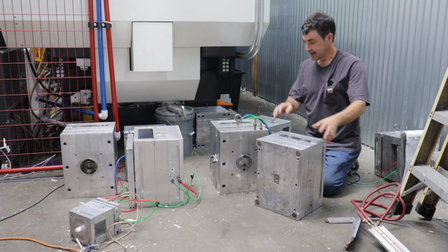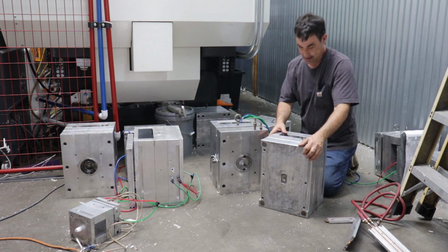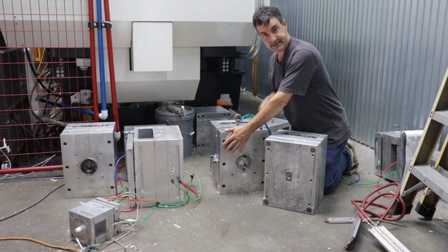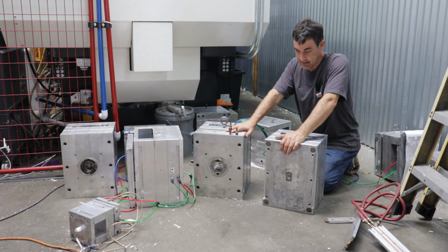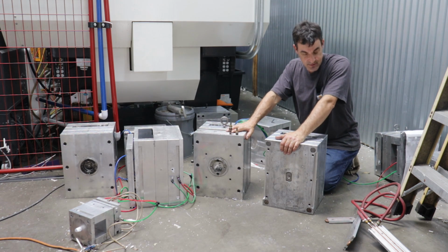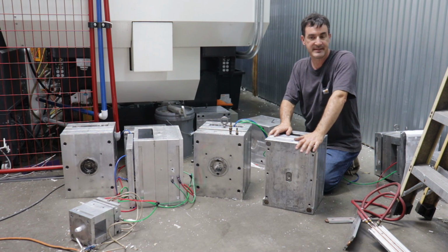So I'm going to show you how I heat sunk the Gametammer mold, which again was 2 polypropylene parts with a large shot size, thus a lot of heat being added to the mold. And what I wound up doing was machining a profile into the mold plate, the A-side plate, which I actually put on a separate mold. These are both 12 by 16 inch molds, and the mold bases are from American Quality Molds. So AQ Molds, if you want to check them out online, they're not sponsored or anything, but they're pretty cool, pretty good prices, and they're made in the USA.